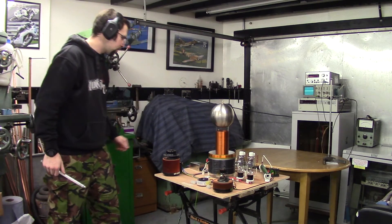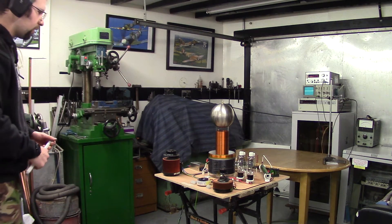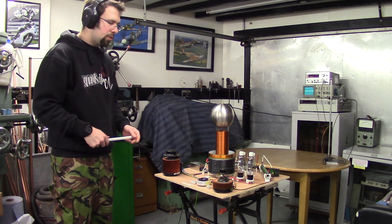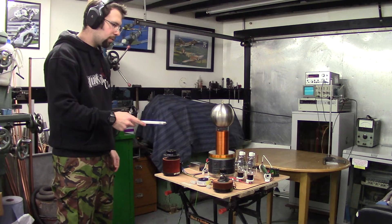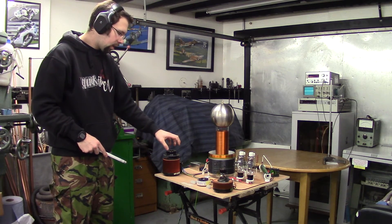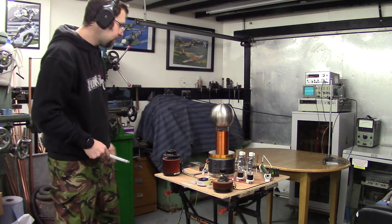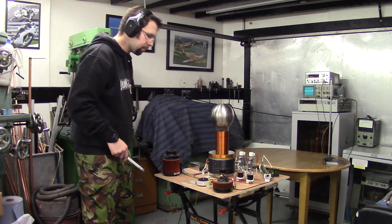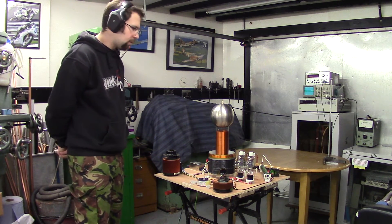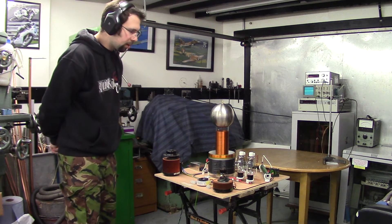The MOT is just warm at the moment, so I'll just let that cool down for a bit. That's pretty much it guys — that's as good as I can get with two 811 vacuum tubes. There isn't actually much difference between one vacuum tube and two in terms of actual arc height. All it means is that I can run the variac up to 115% for a bit longer, and the fan over the back there for the MOT means it can also take it for a little bit longer. It's handier to have two vacuum tubes — it just gives you that little bit of headroom to keep it from running a little bit too hot, balances things out and keeps the loading off stuff.